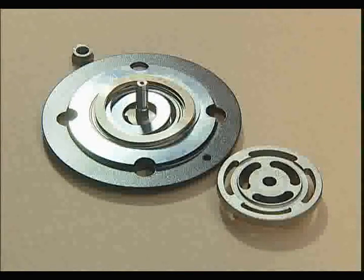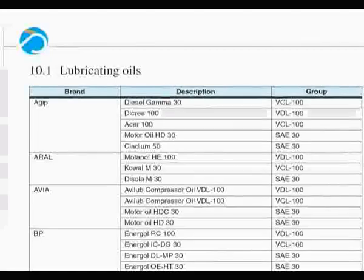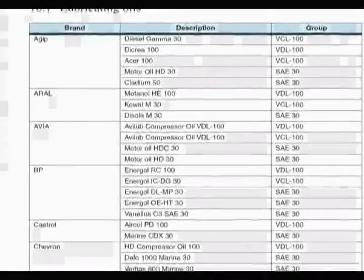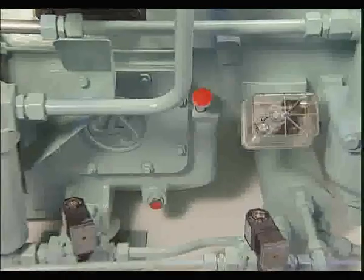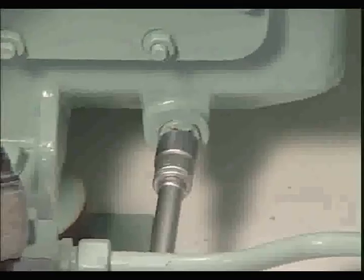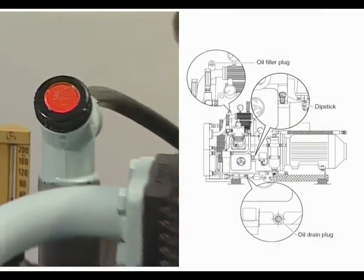The low compression temperatures of three-stage air-cooled compressors again lower the risk of carbonization on valves, even when mineral oils are used. Sauer recommends the use of normal SAE30 oils, as they are also used in diesel engines and readily available. Initial maintenance after 50 operating hours following startup or an overhaul includes an oil change without replacement of the oil filter. It's easier to perform the oil change when the compressor is still warm.